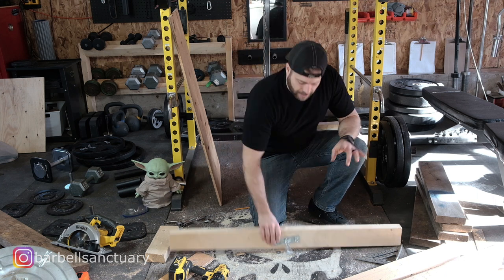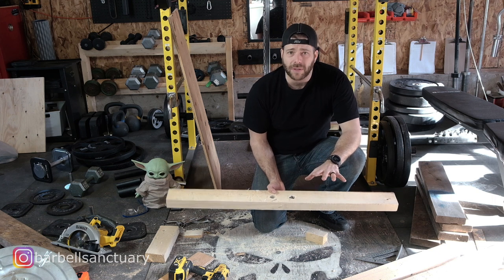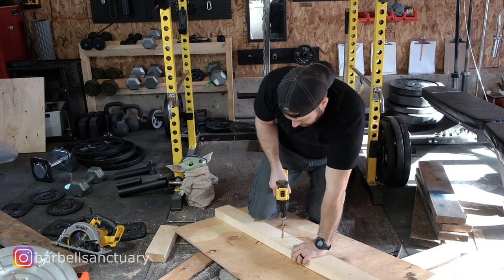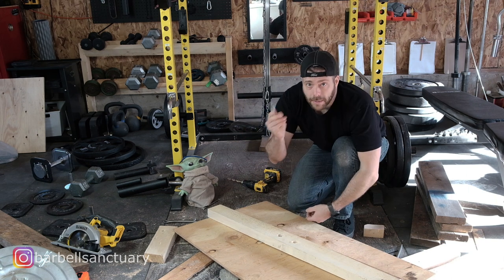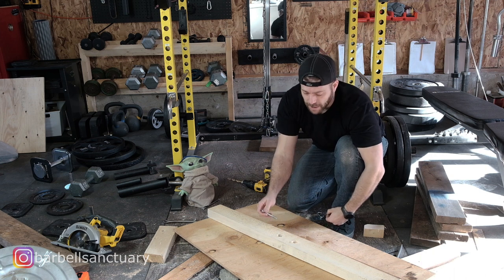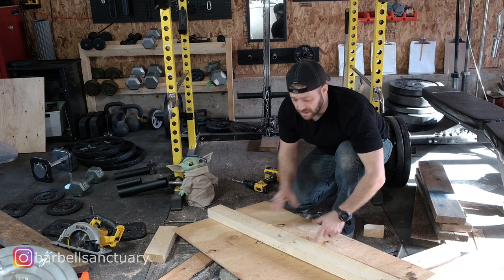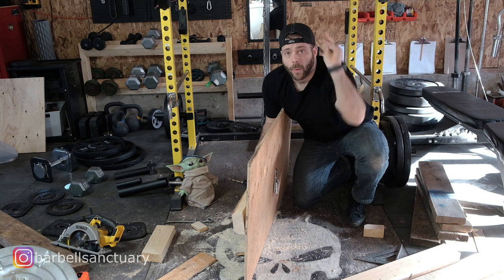I kind of figured out what I'm going to do. I do like the 2x4 idea because it's going to be more solid, but I didn't really like the look it was going to give me once it was finished. So what I think I'm going to do — I'm going to keep going with my plywood idea, I'm just going to put three 2x4s underneath it. Now that I've drilled my holes through, I'm going to put my bolts through the plywood — one washer, a bolt in my countersunk 2x4. So now when I'm using it, it would really have to rip out the whole 2x4 through the plywood, so I'm going to feel a lot safer than with just the thin plywood. And then on the other side I'm going to put my plate — one washer and one nut.